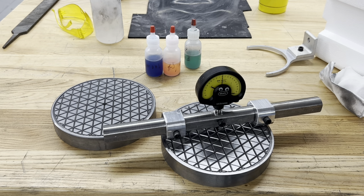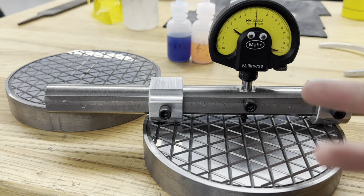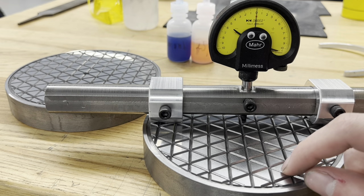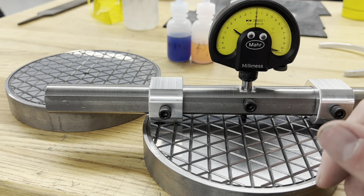So just wanted to show off the plates we made, how we made them, and some of the results we got with them real quick. The motivation behind these was not just wanting lapping plates to make things flat, but it was also slightly related to the diamond turning lathe project. The x-axis rail basically determines the straightness of travel of the entire x-axis, so it of course needs to be very good.